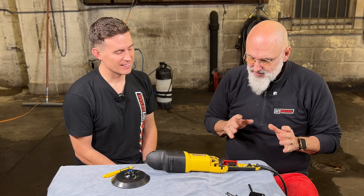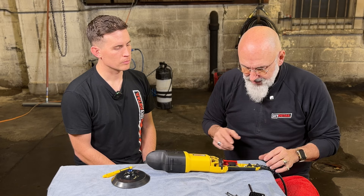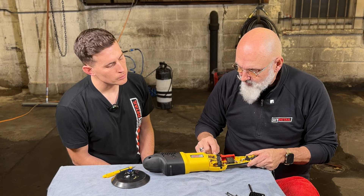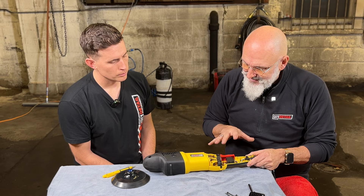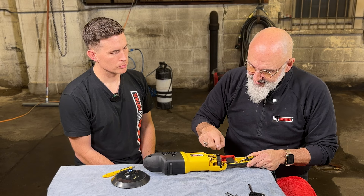There are people who just want to buy the tool and use it and never open it up — and that's great. But if you do a little maintenance once in a while, it's great too. One of the features we really looked at was wire management. I've been in power tools for decades — I used to work for Porter Cable doing R&D. One thing I didn't like about many tools is how cords inside just don't have a place. We have cord management pins — everything to hold the cords and wires in place so they're properly located. The switch is very simple to change: four wires screwed in, not clipped, so they're easy to access. The speed controller is the same — you take both sides of the handle, it just slides up, a few connections, and it's good to change.